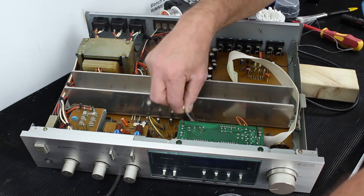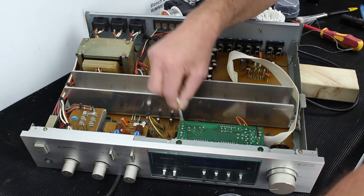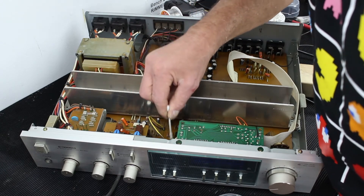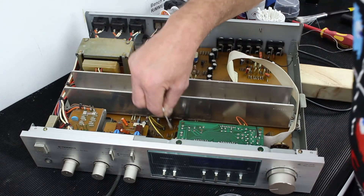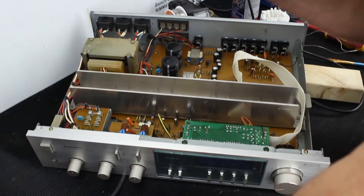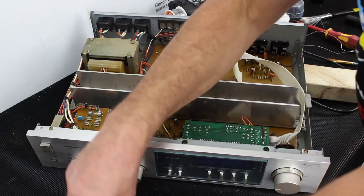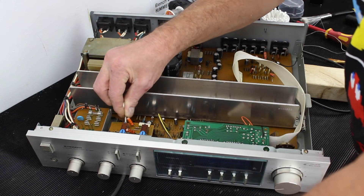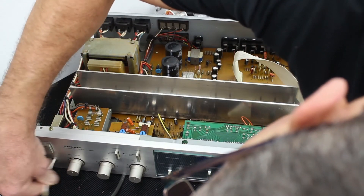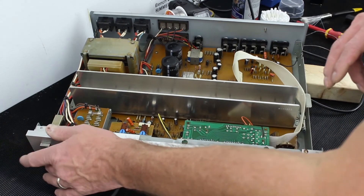You may ask why it's important to do this. Any contamination or debris on the board, if it gets damp at any point, can cause a loss of function, especially through electrical tracking between devices. Going around every component and cleaning also focuses you on looking at every single device. In fact, I've just noticed another problem I wasn't aware of — when I tried to clean down in this area, I found this phono jack is all loose and the board inside is rattling around, so I need to sort that out.